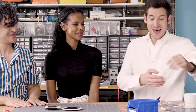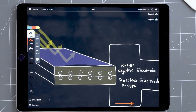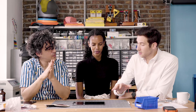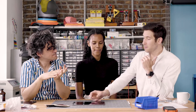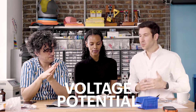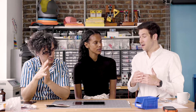Maybe we should explain how the panel actually works. For that, we have an iPad. Here's the sun, and here's your solar panel. The basic construction of the solar panel has three layers: a negative electrode or cathode, a positive electrode or anode, and in between a very important layer — the NP junction. When light comes in, it knocks electrons free from the lower portion, the positive electrode. As those electrons flow up into the negative portion and across the NP junction, it creates what's called a voltage potential. We can attach a battery and LEDs to that, and as the electric current flows, we can turn on a light.